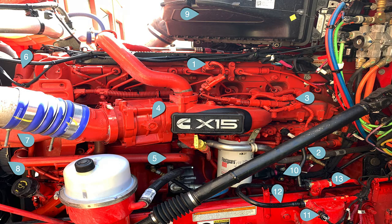Number five is your intake pipe for the air compressor. Notice that it doesn't go up to the intake — it goes around the front of the engine and all the way to the other side. They made this change because they wanted zero soot going into that air compressor, and they finally solved that problem. It was a nightmare for them.